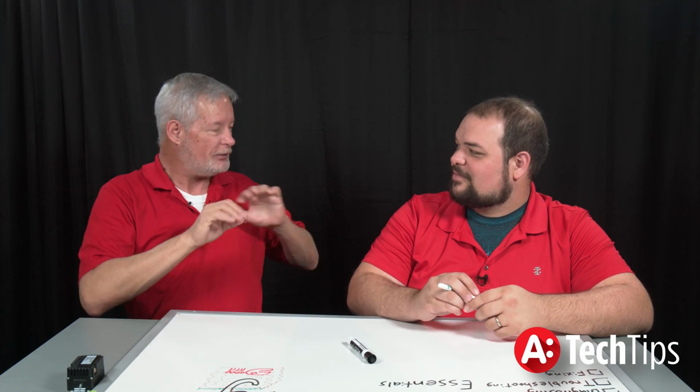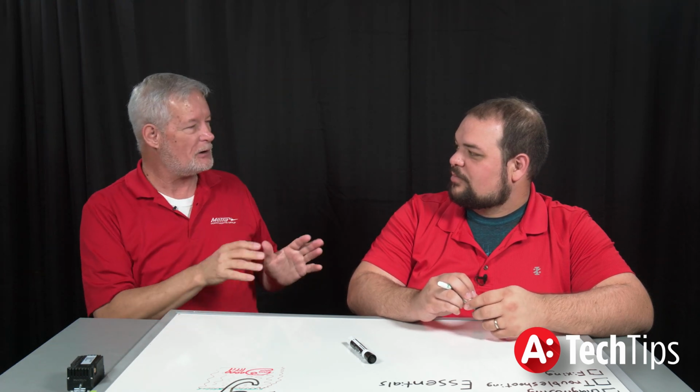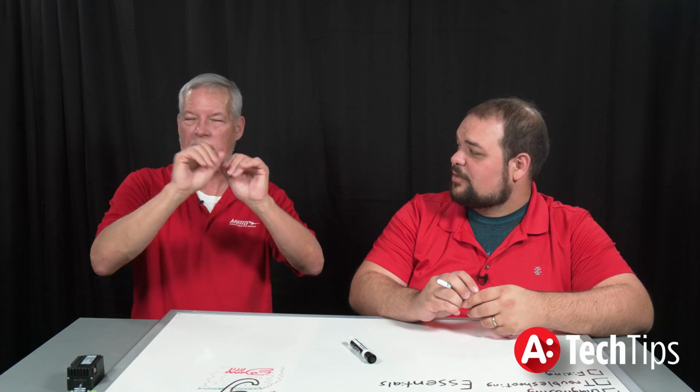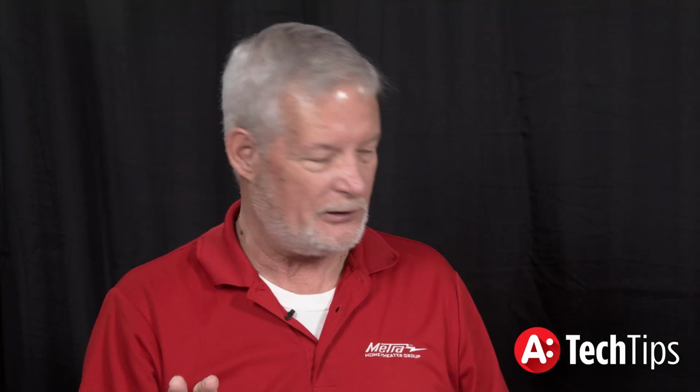Occasionally you'll see a white blooming or white streaks on the screen. We don't see as much of that, and that is not grounding. That is actually voltage on the line, coming in from the cable company, and that'd be another episode of Metro Home Theater Tech Tips. Because we're going to get deep into cable boxes.